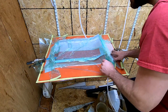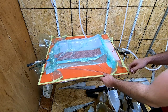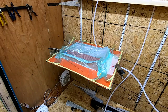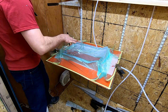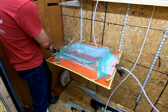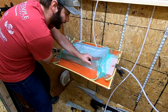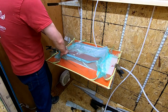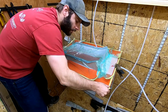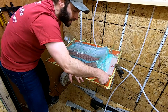You can hear a lot of air getting sucked out because our inlet line isn't clamped off yet — and that is on purpose. With the inlet line not clamped, there's pressure but not a lot, so you can continue to work any carbon or material into any corners. As soon as I clamp off this line, you'll hear the bag really suck down and the vacuum pump in the background will probably change. The two most common places for leaks are at the bottom of pleats or in the corners where the two pieces of gum tape overlap — just give them a good mush and you should be okay.